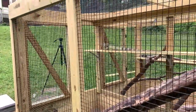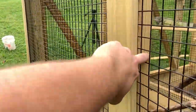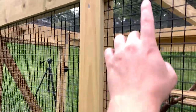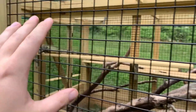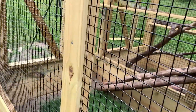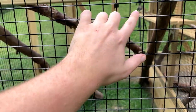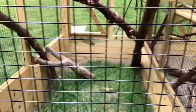With the three boards on the bottom and the 2x4 up on top, the next step was to take more 2x4s and make central support beams — both helping keep the top 2x4 from bowing, because the 2x4 will bow pretty easily, and also giving us something to keep the wire attached to. I have one right here and one on the far wall over there.